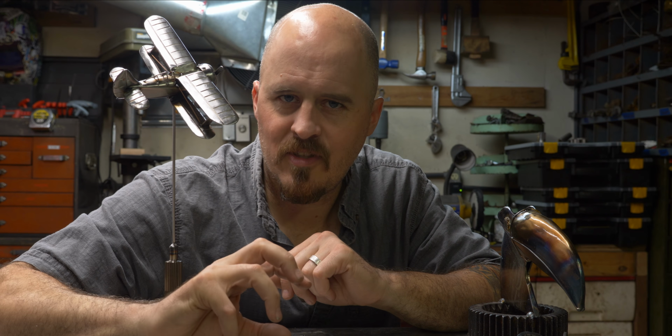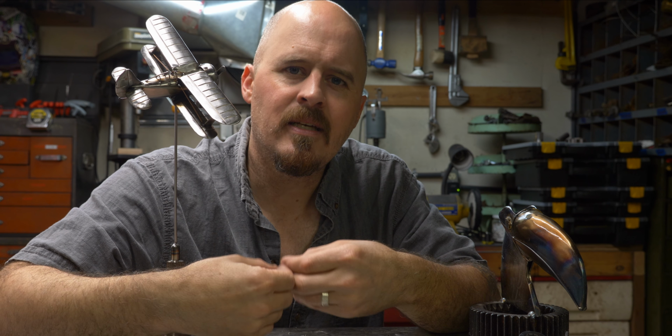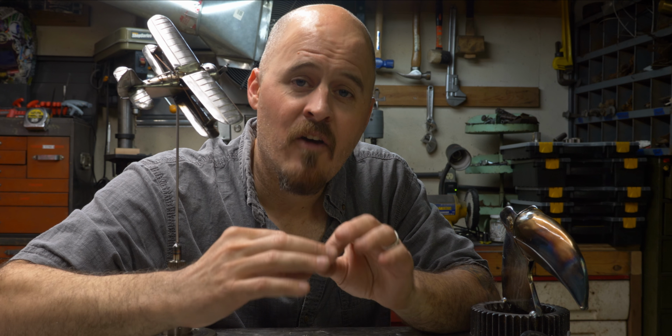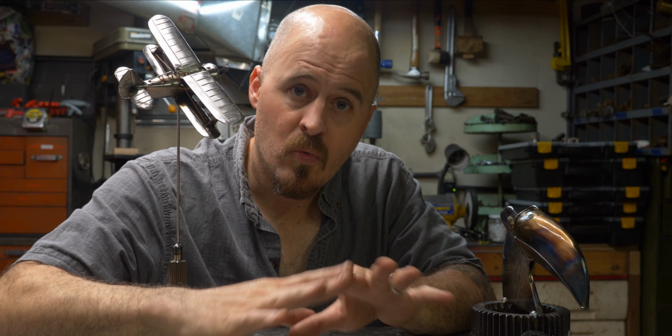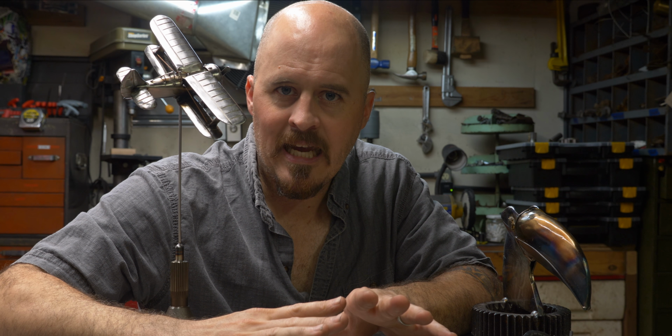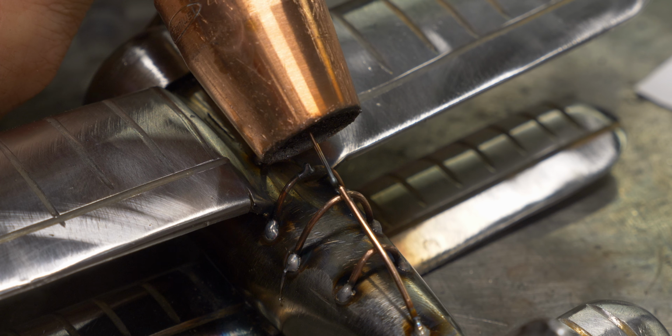And it really isn't a weld. You want to set your voltage down low enough so that when you do a tack, you're not actually really welding the parent material. You're more like depositing filler metal onto whatever you're working with. So it's not structurally really sound, but when you're trying to tack 0.030 wire with 0.030 wire, that's how you do it without blowing everything apart.